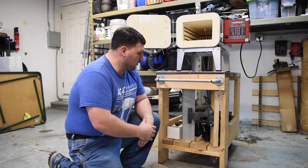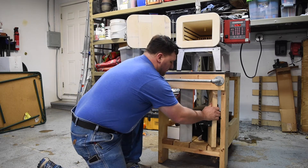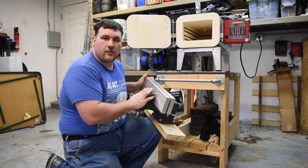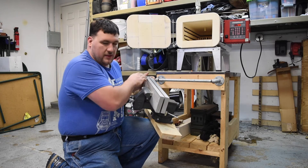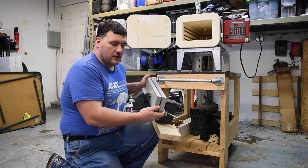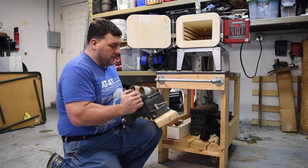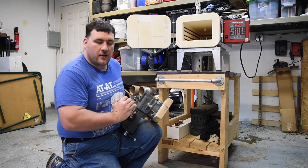Down here I have a lot of the things that I store for my knife-making stuff. The first thing I use is this vise — it's been fully repurposed just for heat treating with these aluminum plates. These are 16 or 18 inches long, one inch thick, four inches tall. It works great for plate quenching and helps physically hold the steel straight while it's cooling as I blow compressed air on it. It's mounted to a 2x6 so I can clamp it to my workbench and get it out of the way when I'm not using it.